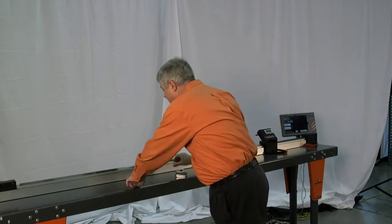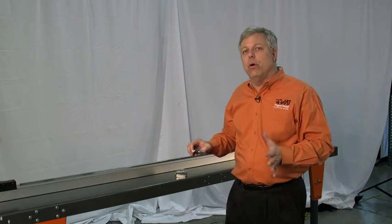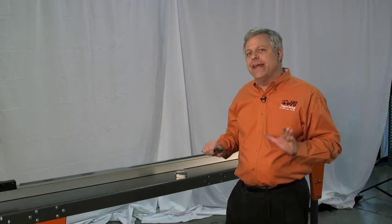The alternative is a pair of calipers. Calipers are terrific and very accurate, but the problem is they're highly limited. This one is six inches. You can get larger ones, but as they get larger they become cumbersome and difficult to hold. So you're left with a proposition of getting inconsistent data from standard quality control devices.